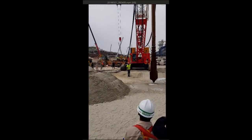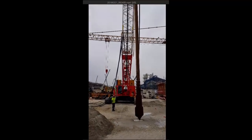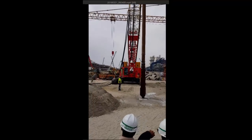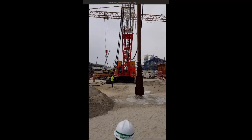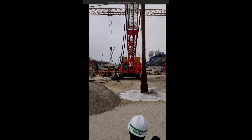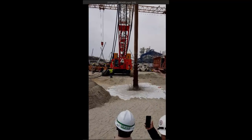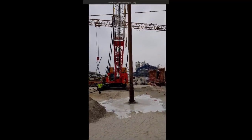The video starts by pointing the vibro head on top of the soil at the pointed end. Then we start the water penetration — as you can see, it takes some time for the water to go through. At the same time the water penetration starts, you feel vibration underneath your feet, and the depth vibrator begins the penetration process, helped by water jets integrated into the vibrator.